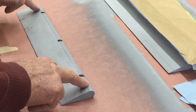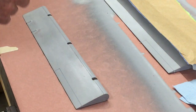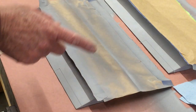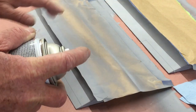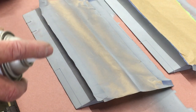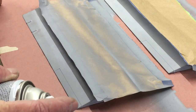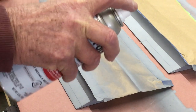This is the leading edge we did yesterday — it's nice and raised, probably a 64th of an inch or a fraction of a millimeter. I'm going to put the masking paper from yesterday's leading edge work just like that, so we don't get a tight line but we get some protection against the leading edge. I've given these two trim tabs a very very light locking coat just to lock up the tape without drowning it, because if you drown it, it's going to get underneath the tape and lift it. Now I'm going to give it a few progressive coats — probably a total of four.